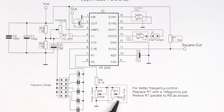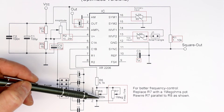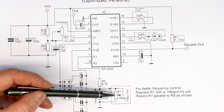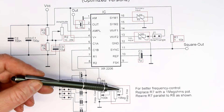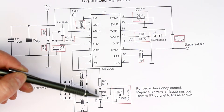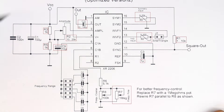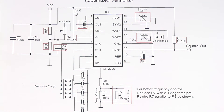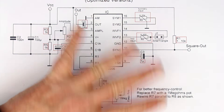If you can get a 1 megaohm potentiometer in the required form factor, you could put the fine control in parallel to the 100k coarse frequency control potentiometer. But I think that's a little bit of overkill. Let's be content with the other improvements — this thing now works like a treat, exactly what I wanted for my purposes. If you liked it, please give it a big thumbs up. Thanks for watching, until next time, bye from Roger, bye from Kankalabs.